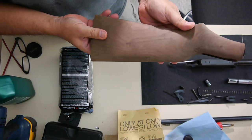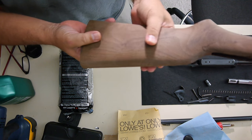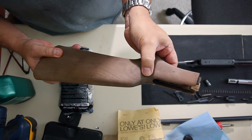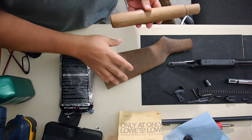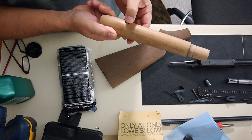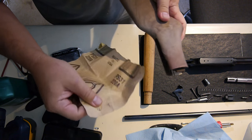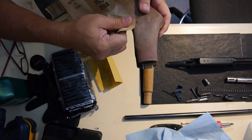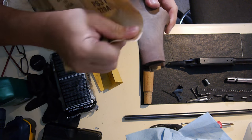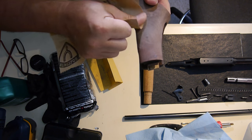So I finished stripping off the buttstock and it's actually a pretty nice chunk of wood — pretty nice piece of walnut. Looks like there's a crack, you can see that there. You can also see the color difference. This section is sanded down and I tried to fill in part of that little dent that wouldn't come out. Now that the glue is dry, I'm going to start with 220 grit to sand out all the excess overlap glue and get it all smooth again.